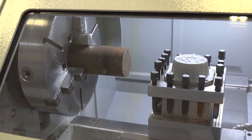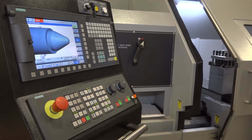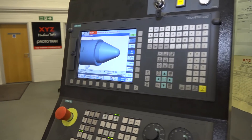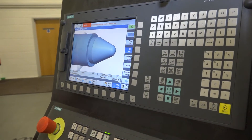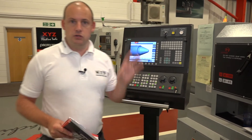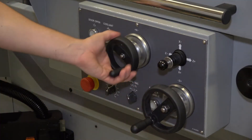We did speak about the through bore of the spindle. I want to touch now on the control of this machine. This machine has a Siemens 828D control. It's got the ShopTurn software, which is very heavily focused on user-friendly compatibility. It means you've got good graphics, it can simulate, and if you don't know much about CNC programming it's very easy to pick up. You may well be a manual turner currently, but you want to learn about CNC turning — this is a very good control to start on, and XYZ do training here too. But if you don't want CNC and you want manual, you can still use the XL780 with the manual handles.